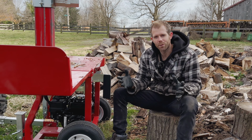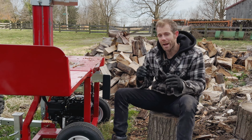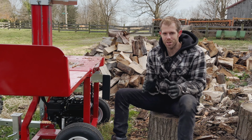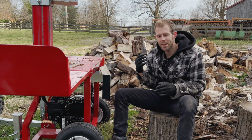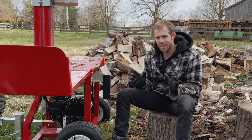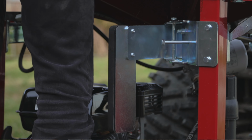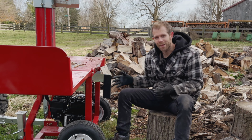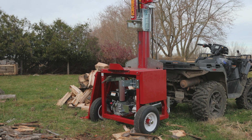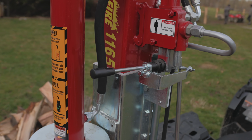And so for a foot pedal, it didn't make sense for us that if a person was going to pinch themselves or have their hand in the wrong spot, they were going to tense up and stiffen up on the foot control before their brain could realize what was happening and release the pressure off that foot control. Whereas with the knee control, it's very simple. Your knee is in somewhat of a bent condition already when you're operating it. And so if there's an incident and you stiffen up, your knee will automatically come off that knee control and the machine will go up into its home position. So from a safety point of view, that was the most important, one of the first reasons why we said, hey, a knee control might be a better way of doing this.